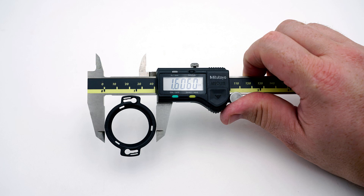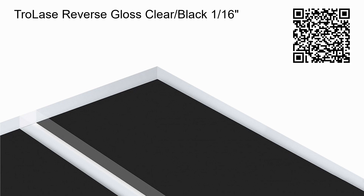Once completed, it will look like this. This design can now be converted into a laser engraved and cut gobo to fit this projector. A transparent plastic coated on only one side will be necessary for this process to work, such as painting one side of clear acrylic. For this test I will use Trotec's reverse plastic — a stock laser-safe transparent plastic with a coating on one side. This material will produce a clear window and allow light to pass through when that coating is removed with the laser, and should also work for this gobo application.